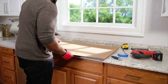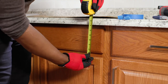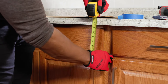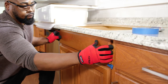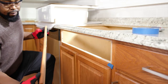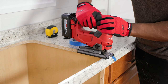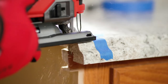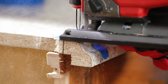The apron front is designed to extend past the front of the cabinet. Take this measurement before making cuts and accommodate for the apron depth to align flat against the front. For a standard sink base cabinet, the front drawer or false front will need to be removed, as well as a top header support rail. Make cuts to the countertop and cabinet front using your template. Notches will need to be cut on the front countertop edge to accommodate the apron front.